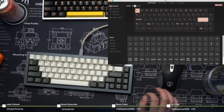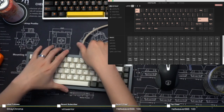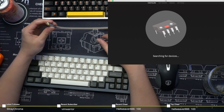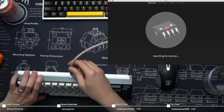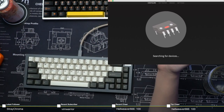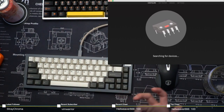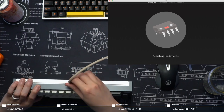Yeah, but assuming you've done this all correctly and you have your board flashed with the VIA firmware. See, I unplugged the board. As soon as you plug the board in, as long as you've got VIA open, VIA should detect it right away. And of course it doesn't happen all the time, so sometimes you just need to unplug, replug.